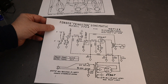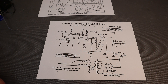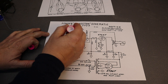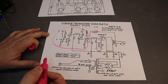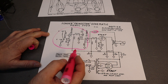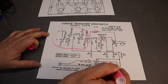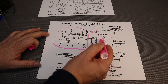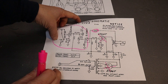Here's a brief schematic overview of what we're going to do — once finalized, a proper schematic and layout will be in the description for download. On a high level, we'll use the preamp section and utilize the negative feedback loop with a switch to toggle it on and off. We're not using a 6V6 or a rectifier tube — we're going with solid-state rectification and using the 12BH7, tweaking the values to make it work for the tubes we're using.